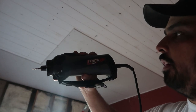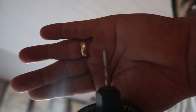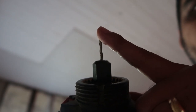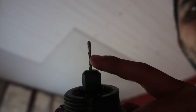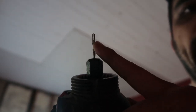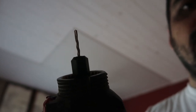I've covered up the hole where my light fixture goes — there's the box up there. That's not a mistake, because instead of measuring ahead of time and cutting the hole trying to get it as perfect as possible, we use a little router. This particular one is by a brand called Rotozip or Roto Saw, which you can get at Lowe's. It has a special router bit that cuts on the sides but not on the tip — only on the side. This is what they call a guided tip. It'll punch through the sheetrock, and then this little guided tip runs along the inside of the box and cannot cut through even a plastic box because it's not sharp, but where it's touching the sheetrock it cuts fine. You just run it around the perimeter of the box and get a perfectly cut hole without damaging the box. It makes a bit of a mess but makes things way easier for all your outlet boxes and light fixtures.